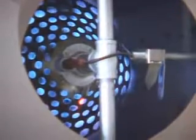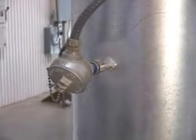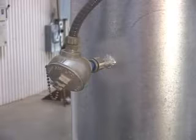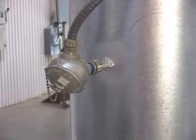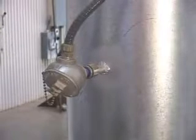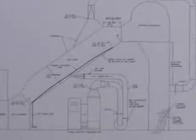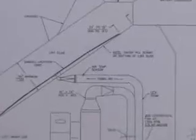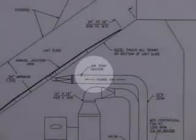The Humidaire's burner is regulated by a thermocouple temperature sensor that is to be installed in the moist air pipe. For most applications and climates, we recommend placing the temperature sensor, which is color-coded blue, in the pipe close to the point where humid air enters the application device. For example, this might be just before the transition to the lint slide grid underneath the lint slide.